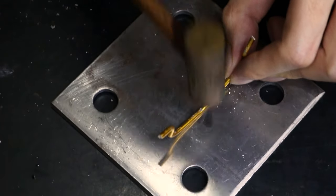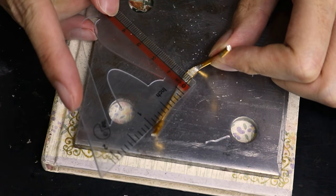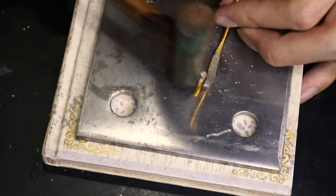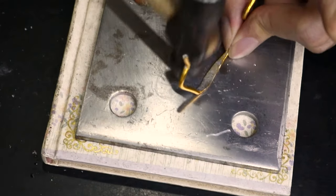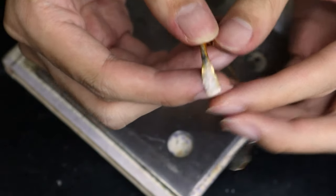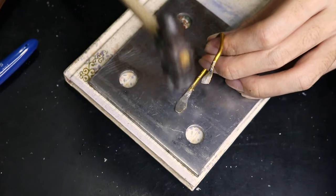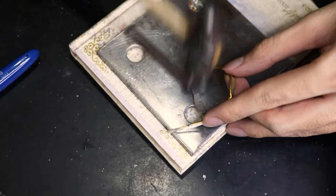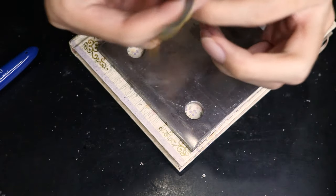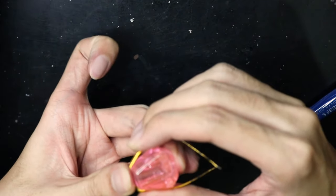Now I'm chasing the middle section of the wire on a bench block to flatten it out. This extends the area of the wire so I can put a screw through and mount it on top of the sphere later. Then I also chase the two ends of the wire, which will be where we mount the cross on. And you can really tell the wire is not real gold, as after we hammer the wire, the bare aluminium shows through.